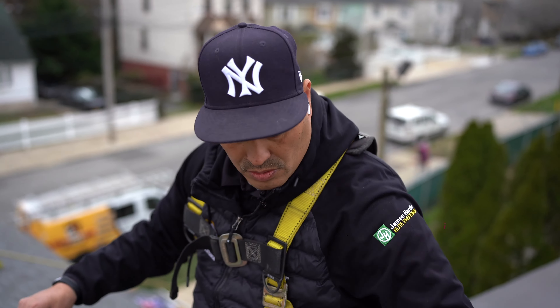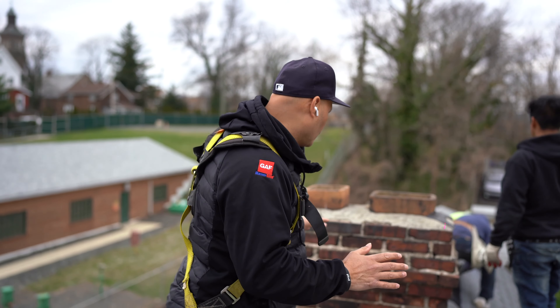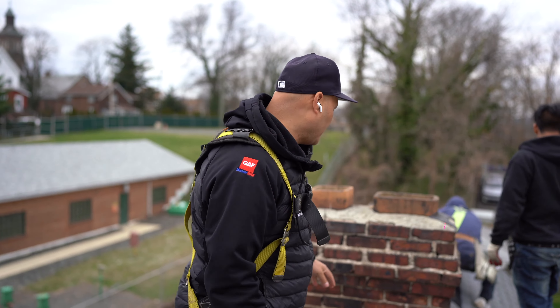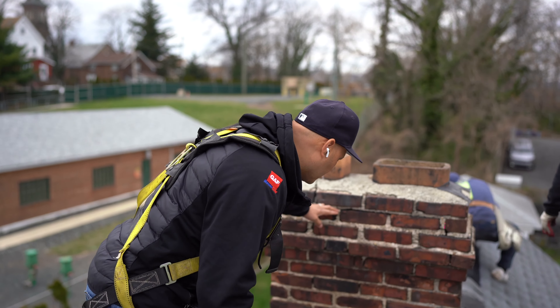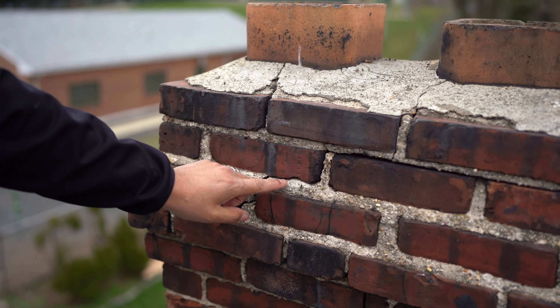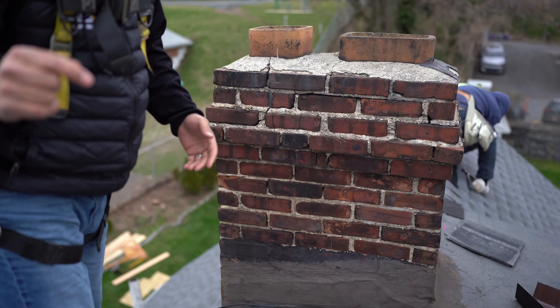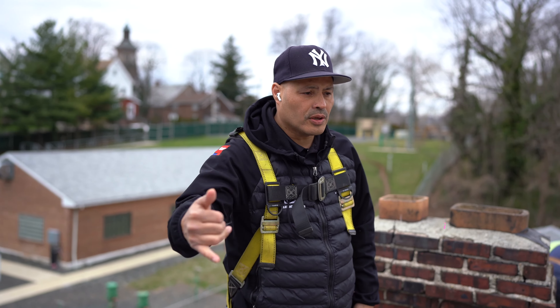Now that there's a space — an inch on this side and an inch on the other side — they're going to cut this felt buster underlayment off and then install a ridge vent. If you go to this other side you can see how the ridge vent looks. This is a GAF Cobra ridge vent, and it gets installed over the top, preferably hand nailed.